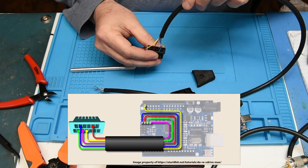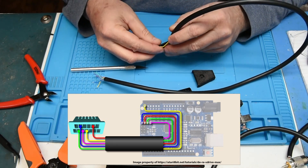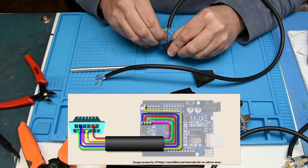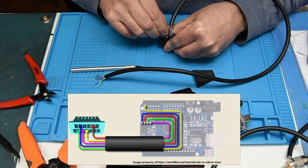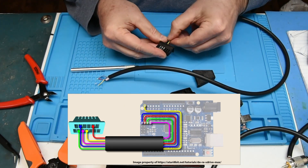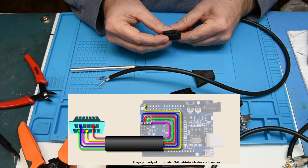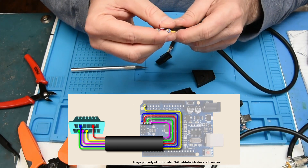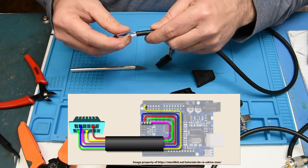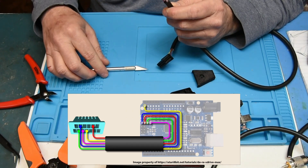If I hold this up and look at how this is in there — yellow is the last one to go in, it goes on the bottom. You basically just push it in there until it snaps or doesn't come out again. That little metal clip holds it in place. On the other end, I've tinned the other connections and we're going to hook those onto the Arduino board.